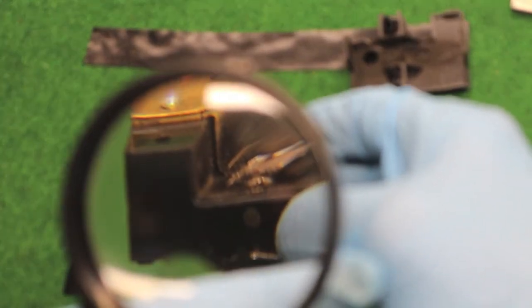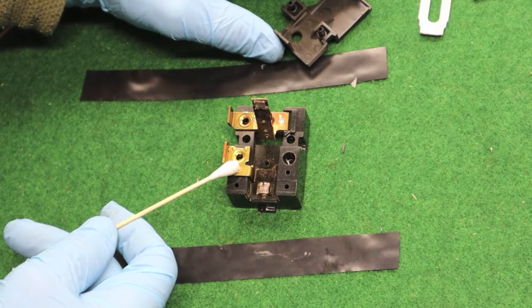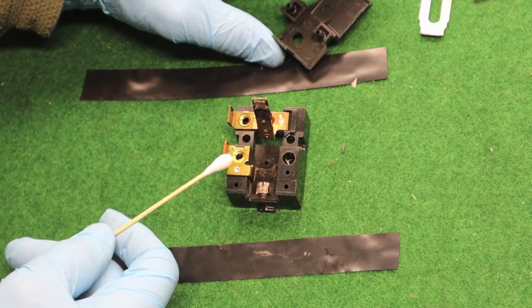Contacts have a lot of sharp, jagged edges left from burning traces, arcing. While I was troubleshooting it, I actually caught two of the last times it opened up. And there was a tremendous amount of blue sparks and arc and a loud crack and burning sound.